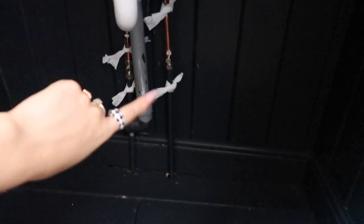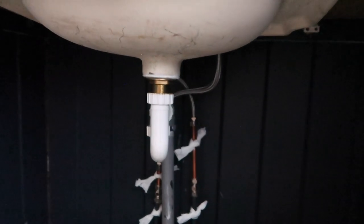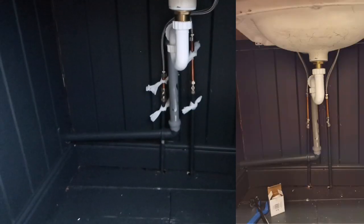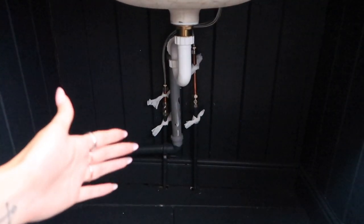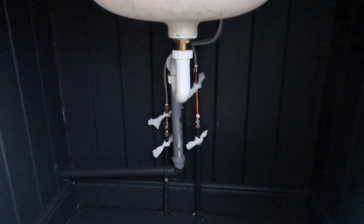So there originally are the copper pipes and the isolation valves. I then had flexi tap connectors — the female end goes into the tap and the male end goes there. Hence I added some more copper piping. Then I realised this is actually the cold tap — I just expected the hot tap to be on that side and it wasn't. So I've had to just change things around a bit, but look — it works.